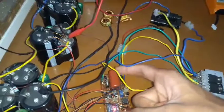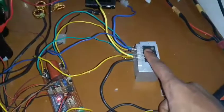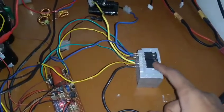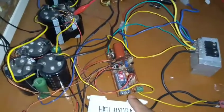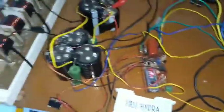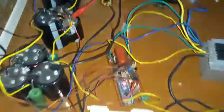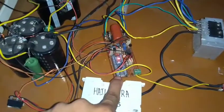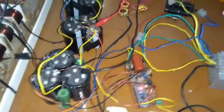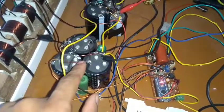The charger circuit contains a ZVS driver and these are the IGBTs — they can handle around 2000 watts pulsed. I'll put the part number in the description. This Arduino is helping me in triggering the stage IGBTs. Below this Arduino I have optocouplers to isolate the gates of the SCR.